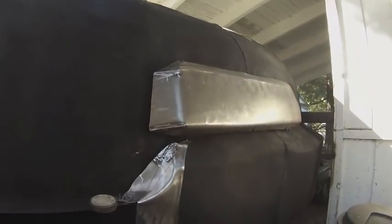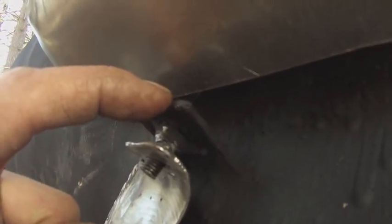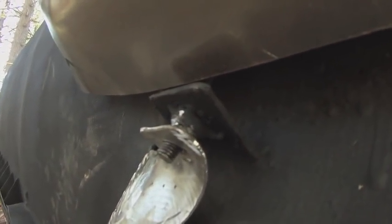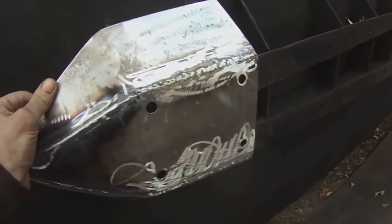Here's cover one — it's covering the cooling pipes for the engine. There are cooling pipes on each side. Here's what the covers look like; they're not bolted on yet, using this magnet to hold this one on. And that's how they'll sit on the hull. They're all bolted on to tabs so that if they rub against the tab that won't compromise the hull and create a leak — except for here, there's no tab, but this doesn't matter if it leaks anyway because there's going to be water filling this compartment. This is the piece that will go on the front of the keel attachment framework, and that is the last thing I need to do on the bottom of the boat. So I'm ready to flip it back over.